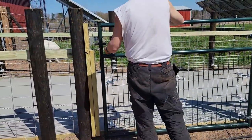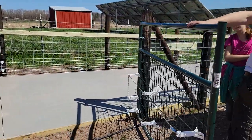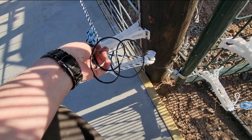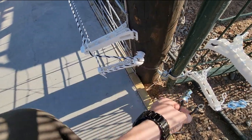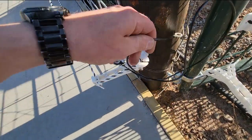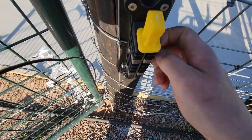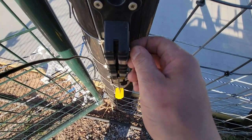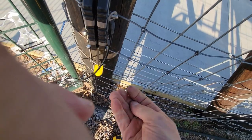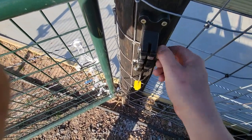I recommend test fitting it. That gate handle lock there is one of the best gate locks — I've got a video on that too in the playlist. It works great and allows the gate to go up and down in case of winter frost changes. I've got basically a tie with two round wire ends — you can buy these at Fleet Farm, get some extra wire, make it yourself, doesn't really matter. I'm going to attach it to the inside of the fence where it's hot, run it behind the gate, come up this post, and tie it right into a switch. I like these knife switches — nice big yellow handle. I like big switches that I know when they're in their down position. I don't like black-handled knife switches because I can't see them from a distance. This way I can see them when I'm driving by.